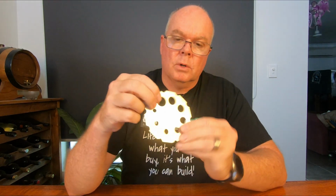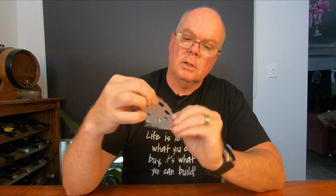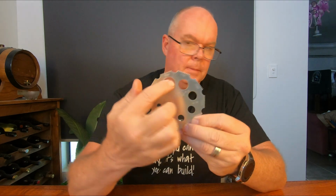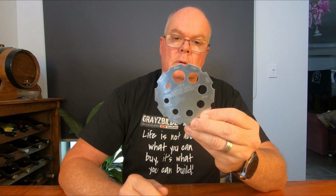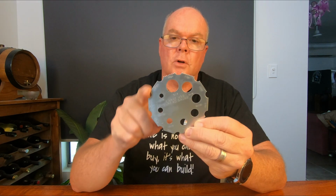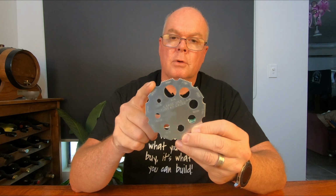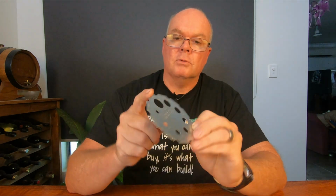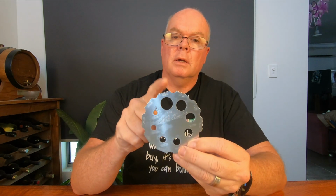And around the outside it has 3/4, 5/8, 9/16, half, 7/16, 3/8, 5/16 and 1/4. Great for quick and easy identification of those sizes. And then of course you've got your more coarse thread pitch gauges around the outside. The smallest one here is 28 TPI and goes right up to 10 TPI, most coarse thread there.